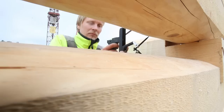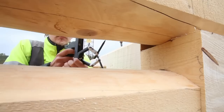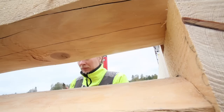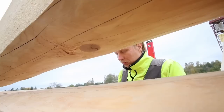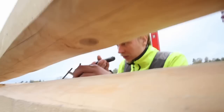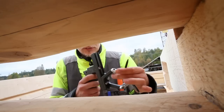Carving the log proceeds by cutting off all the wood matter between the scribings of the upper log. Then the smallest level distance makes the notches the tightest — something like three millimeters to the outer side of the groove and 1.5 mm to the inner side.